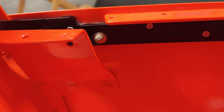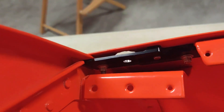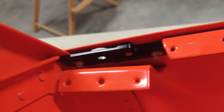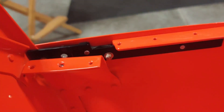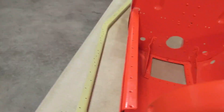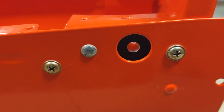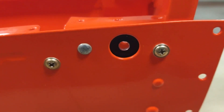Here's our installation. Notice we use bolts and nuts. That's a horrible place there to try to buck a rivet anyway. We've got a bolt, a number 5 rivet instead of a number 3, and then another 5/32 bolt, and then we go back to the standard little rivets. But basically these bolts are carrying the load. These guys are tough. And as you all know, riveting is an art form — bolting is a torque form.